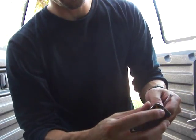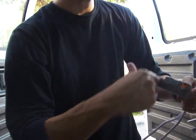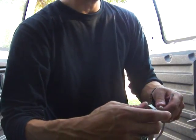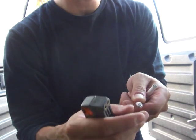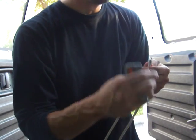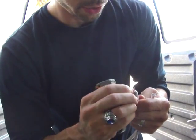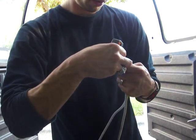Put it flush like that, and then squeeze it a little bit. Take it and run it clockwise — you'll hear it cutting, a kind of crunching noise. If you don't hear that, go the other way. See how the braids — the ground braids — are touching the copper prong? You need to take that off, or else it's going to short out the cable. Make sure the dielectric, the white part, is clean.